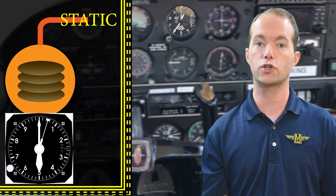Inside the altimeter is a set of bellows that are sealed with some air. The body of the altimeter is connected to the static port on the aircraft. As the pressure on the static port changes due to climbs or descents, those aneroid bellows can expand and contract. This movement is converted to rotation through linkages and gears to spin the needles on the face of the altimeter. Once the pressure inside the aneroid and the pressure in the body of the altimeter are equal, the needles stop spinning.